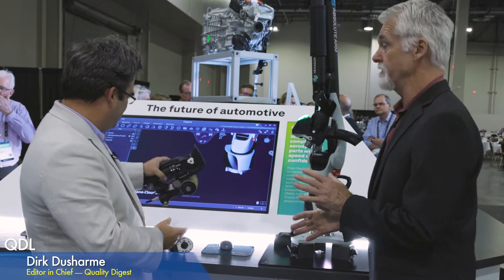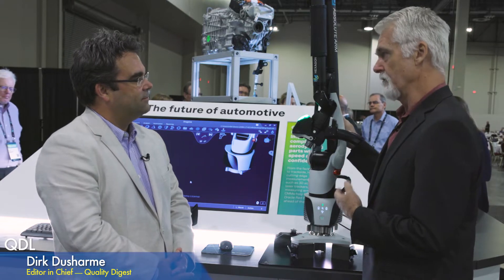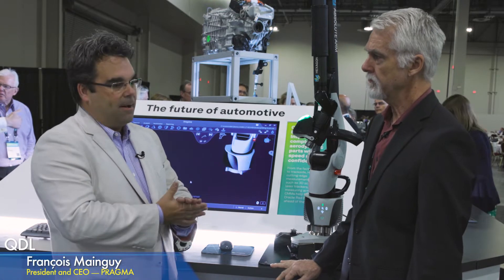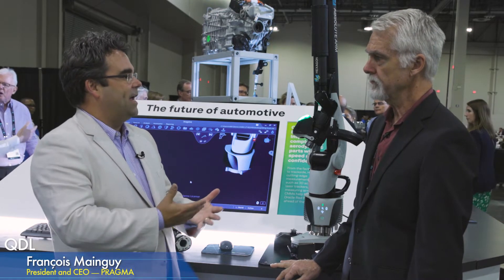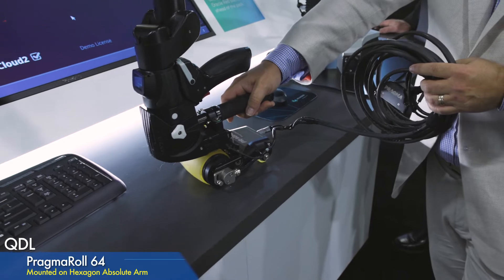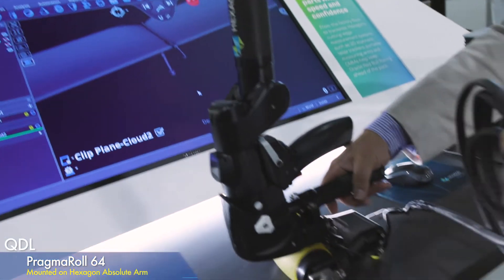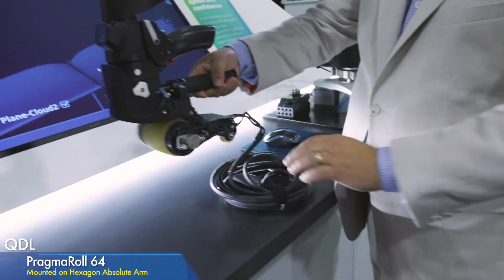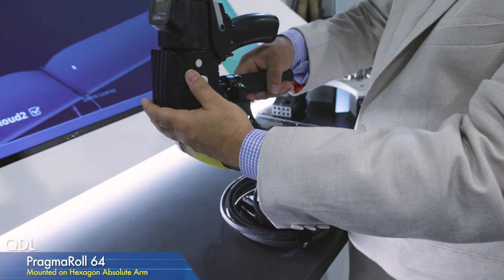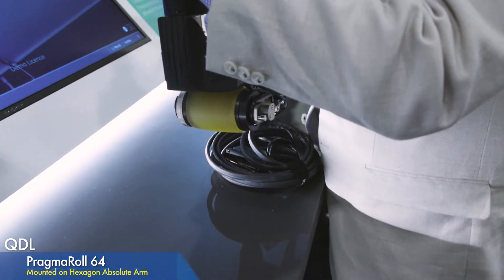What is the advantage of attaching your sensor to the end of an arm? It comes down to having an absolute position. Right now, the deployment of ultrasound for NDT is typically a manual operation where position encoding is very dependent on the human factor. They might grid out a part — they might say on a linear scale I'm starting here to go to there — but what is 'here'? Unless it's documented or photographed very carefully, quite dramatic mistakes can happen.